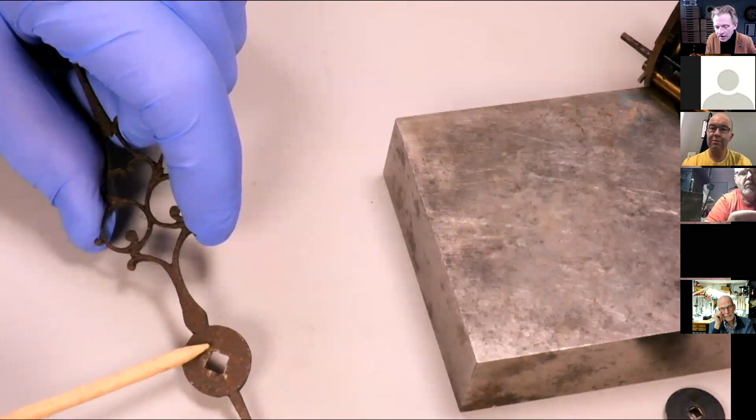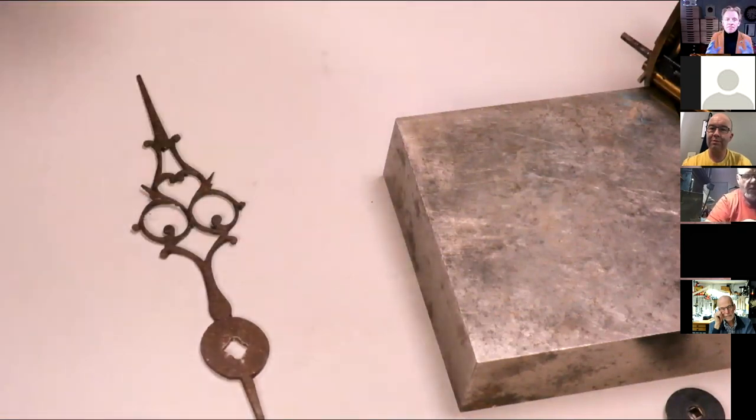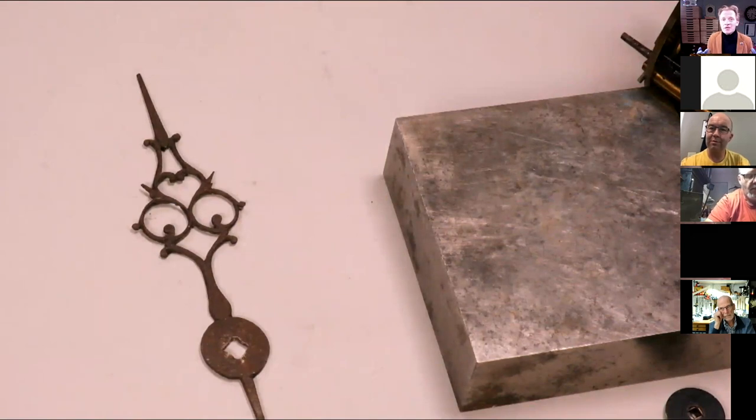So to open the hole more, and rivet in a piece of brass or even rivet it solid with a plug and then begin to open up again. Obviously, it's a bit like bushing when you make that decision. You have to think of this cost benefit thing: I'm going to actually remove material to add material, but on the benefit side, I'm going to make the thing much more stable and stop the hand from wobbling about.